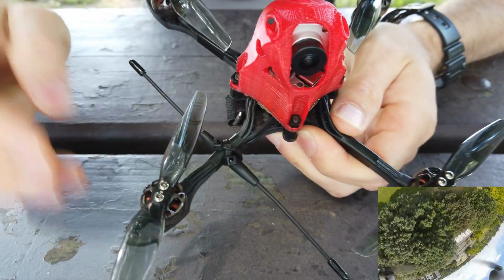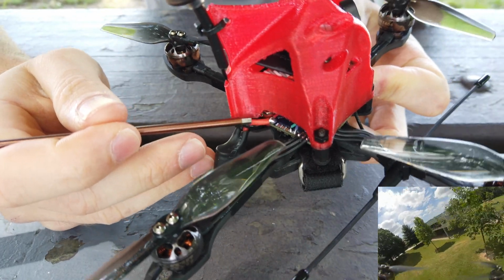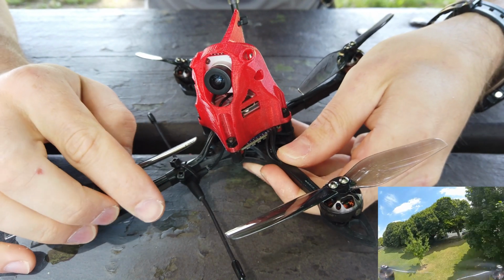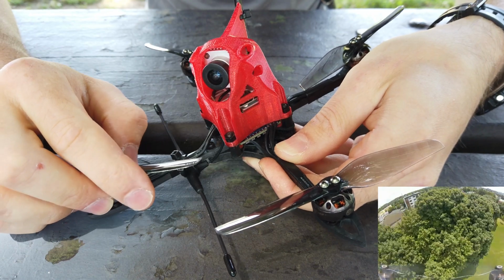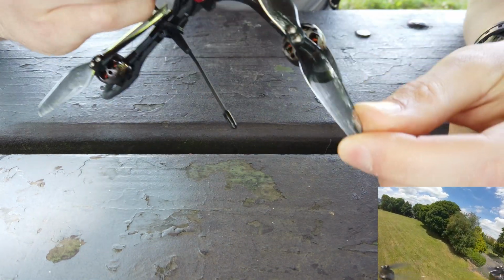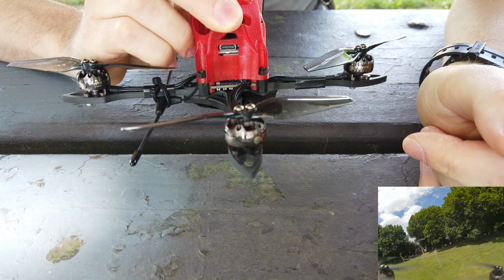As for the rest of the specs, I'm using the JHE MCU all-in-one board, the one that Kebab FPV recommends, and so far no problems there. I'm running it on 3S because it most mimics the way my Beast class cinema rigs fly. If I did 4S, that would just be too much power and it would throw off my game. And I'm using 1404 Flywoo NIN motors.